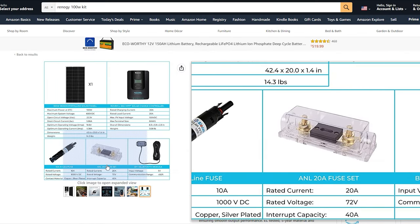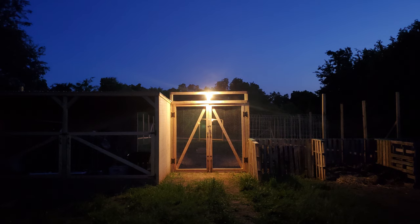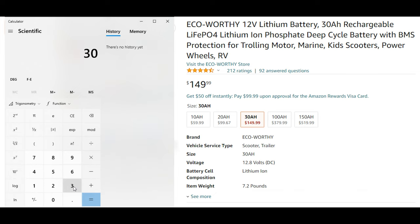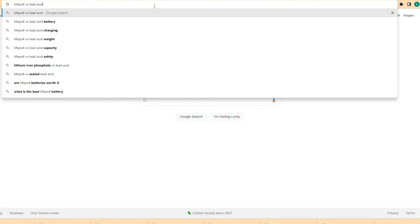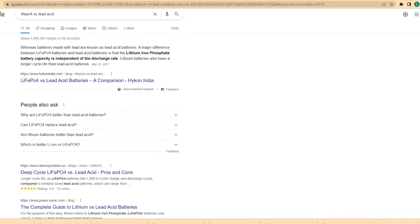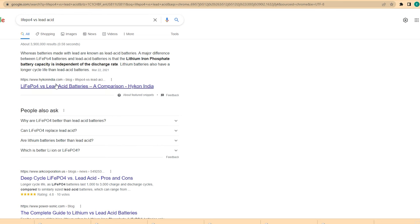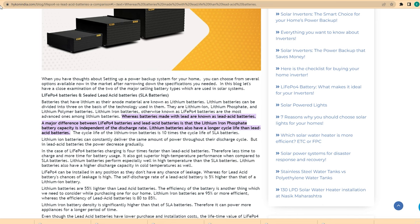It also comes with all the cabling we need, plus a fuse, and the ability to add a Bluetooth controller/monitor if you'd like. Knowing we are running multiple sources from the system and want to draw on it at times it cannot be charged — like at night — if we add a small LiFePO4 battery we can do just that. A 30-amp-hour battery divided by 8 amps gives 3.75 hours of runtime for the pump, plus our 20.8 watts per hour from the panel will consistently be trying to charge the battery. We have plenty of headroom. I encourage you to research the difference between LiFePO4 and a conventional battery, or mono versus polycrystalline solar panels. I'm going to be running a 100-watt monocrystalline panel and a 30-amp-hour battery.